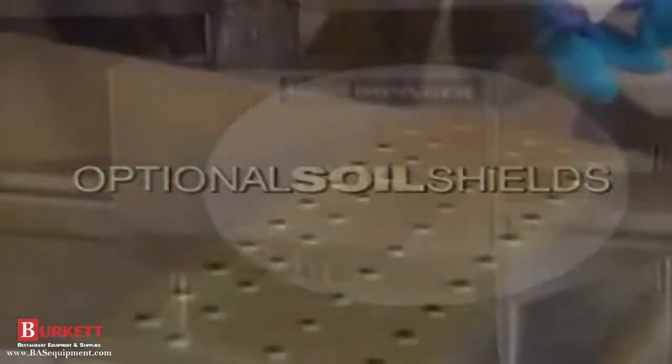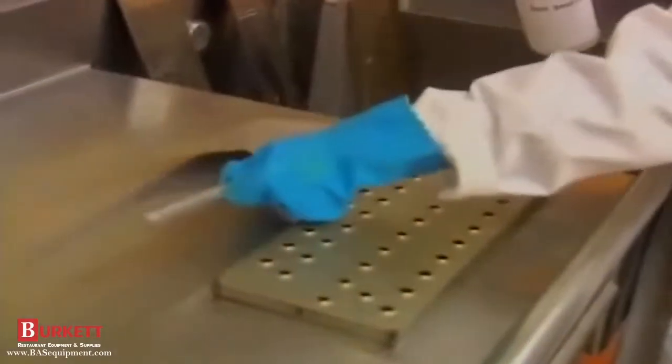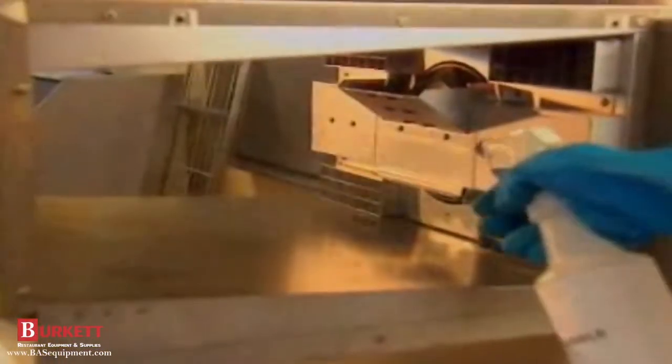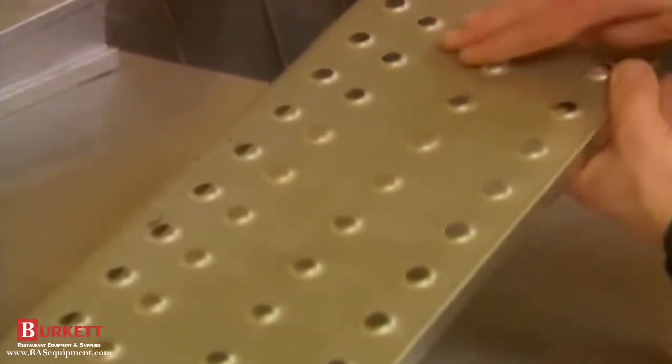To make the Impinger weekly cleaning tasks easier, there are spray-on soil and grease guards available. These soil shield products are applied on clean oven parts, finger covers, air return baffles, and the inside of the oven cavity. After application, the soil shield product should be dry to the touch before baking food in the Impinger oven.